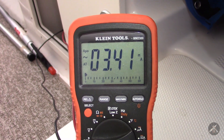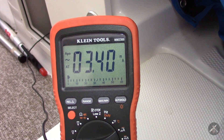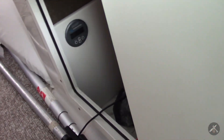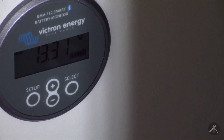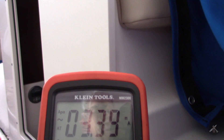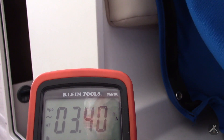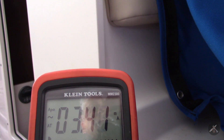Given that the battery monitor is still awake and active — even though it's not Bluetoothing — you get 3.4 milliamps, and the gauge is still showing 13.3 volts. At some point I think it'll go to sleep when it sees activity go away. According to the specs it's supposed to be less than a milliamp. For now I'm going to connect those batteries back up and get the charger on it, and we'll see if that makes an improvement.